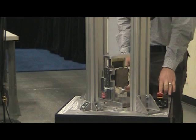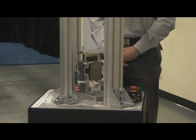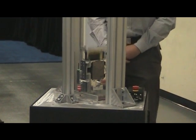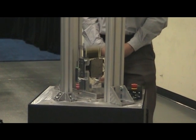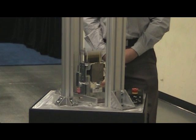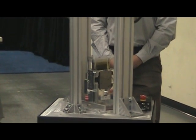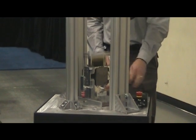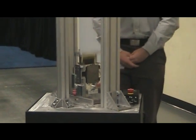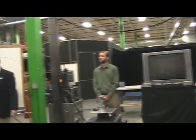So we're going to double it again — that's pretty fast, about a third of the way there. Double it again: this is 16 cycles per second, 16 hertz. That looks very fast, but it's still not fast enough, because remember our eyes jiggle at 20 hertz. So this is still too slow to cancel the vibration that jiggles our eyes. Double it again — that's 32 hertz. That's what I mean by fast in terms of what's required, because that gets us all the way across the whole spectrum in order to cancel out all of those vibrations.